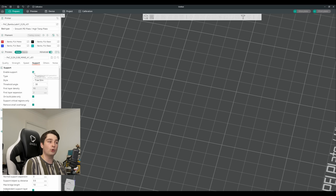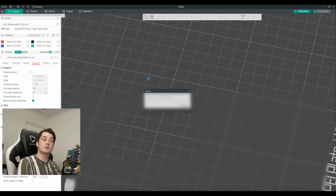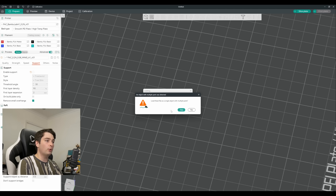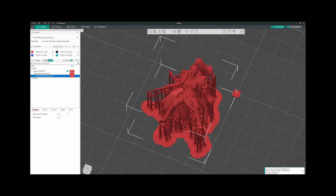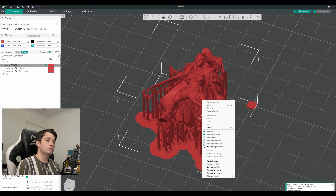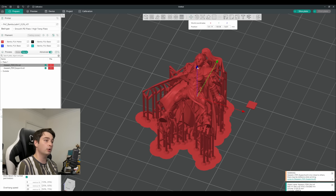I'm going to be using my 0.08 Painted for Combat print profile for the A1 with a 0.2 nozzle, which you can find over on my Patreon Discord. I'll make sure auto supports are turned off. If you're not on the Patreon, the Fat Dragon Games printer profile for the A1 would be your next best bet. Let's find the folder where we saved our model, select both pieces, and drag them into Orca Slicer together. This should bring up a pop-up asking if we want to import it as one model with two parts — click yes. This ensures our mini and supports are lined up correctly. Right-click the model, Split into Objects to separate the two pieces. That cube we made on the build plate makes sure our model doesn't drop away from the supports.